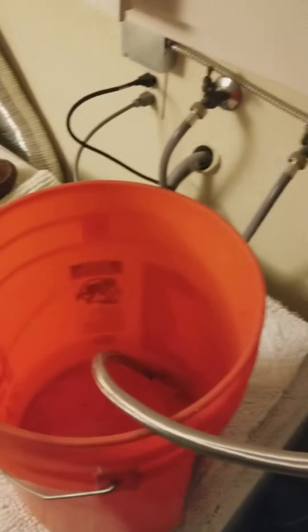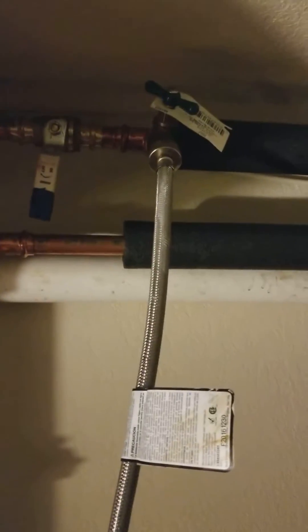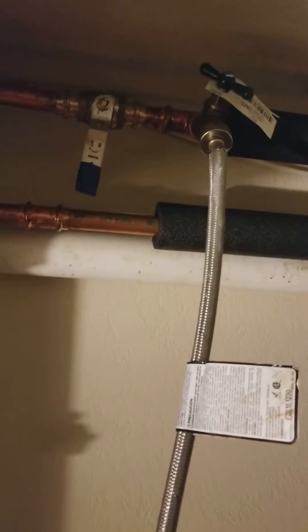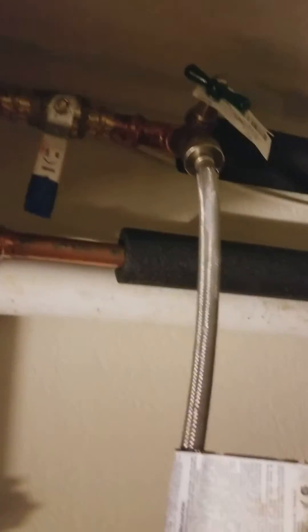What do I need? I need a washing machine hose like this going into a bucket, or outside, whatever you want. We had attached a spigot to the return side — that's the water coming back from the fan coil up above. This is my hot side, and it comes up over here, it comes down over here, and it goes up on this side and returns on this side.